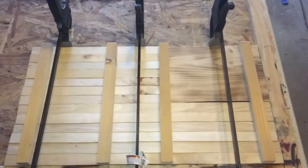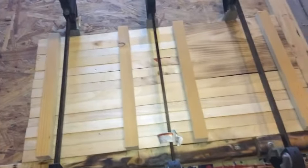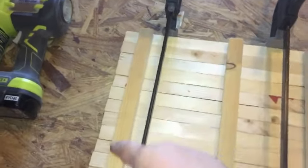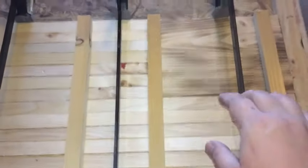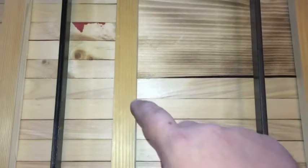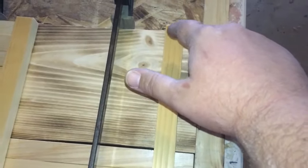I put glue down each brace, and then I take my brad nailer, and I drive in one brad nail for each stripe. The union part, since it's a separate union, what I do is I drive a brad nail on this side to connect these stripes, and then I drive brad nails in on this side to connect the union, and so forth down. Over here, I do one, and then kind of scatter it through here for that union. That'll connect the union to it.